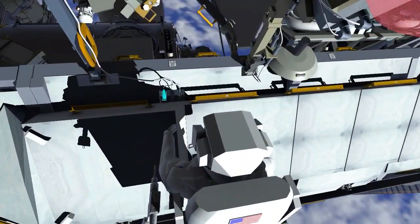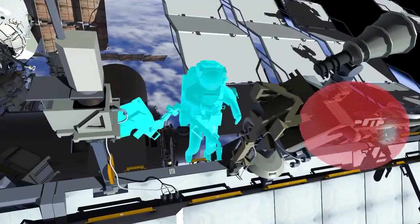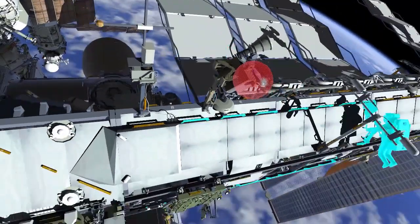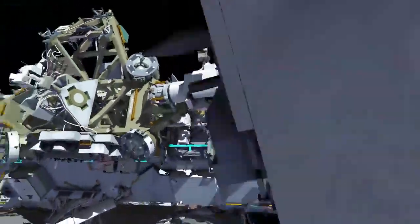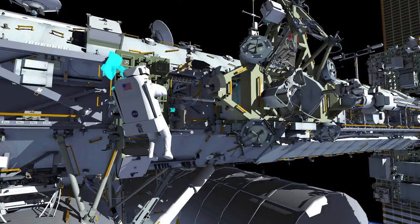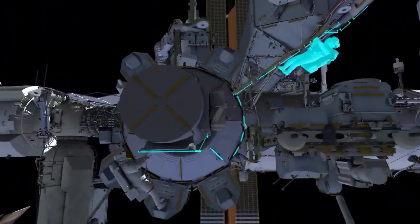Thomas will work to clean up the worksite by egressing the foot restraint and plugging in the EVA electrical inhibit by moving the lever fully forward. He will retrieve his foot restraint on his body restraint tether. He will follow his tether back to the airlock. Under the MT, he will pause momentarily to stow the foot restraint in the starboard CETA cart for an upcoming EVA, and then translate down the CETA spur to the airlock for a successful completion of US EVA 77.